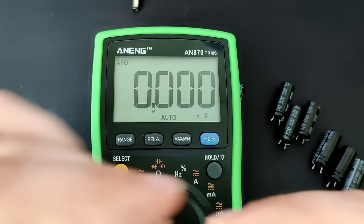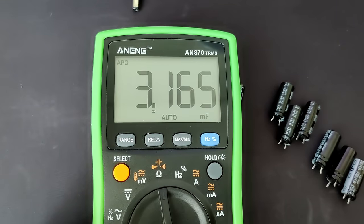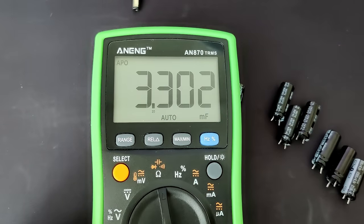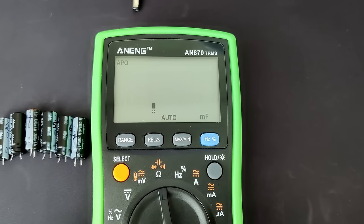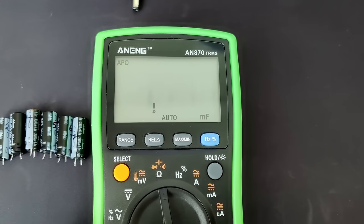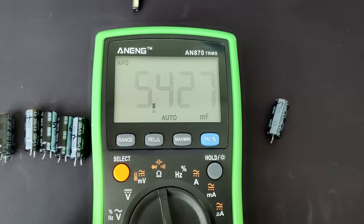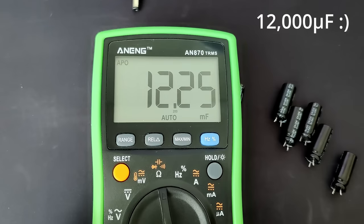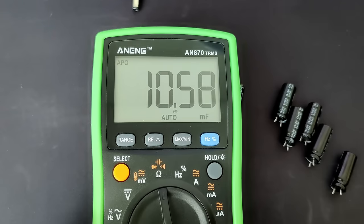Let's do a sanity check and test the capacitors using a multimeter. The blue capacitor checks out at about 3200μF and the green capacitor hits its rated 3300μF. But the capacitors from the motherboard report 6000μF, then 5500μF during the second test. Capacitor 2 also reports over 5000μF, and some of the remaining capacitors read as high as 7000μF. Clearly the capacitance test is not really helpful, at least not with the equipment I have.